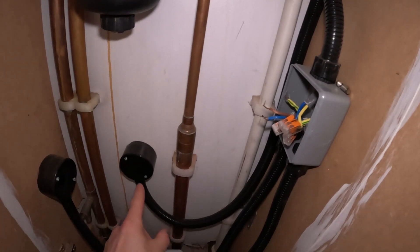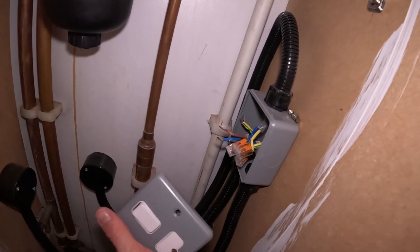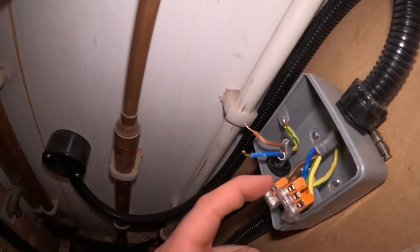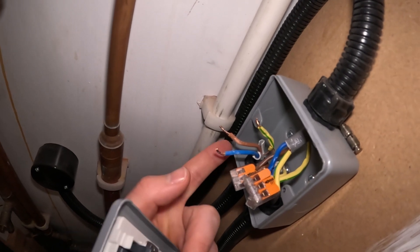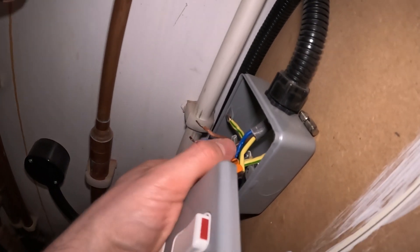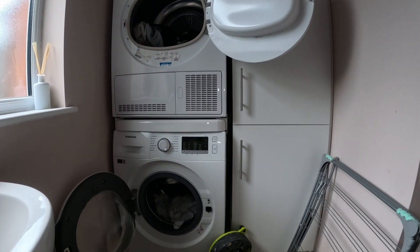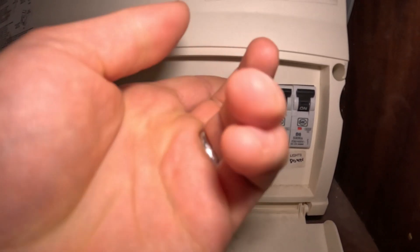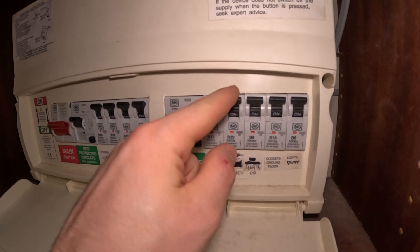In here I just have this fuse spur so that I can switch off the socket outside — it's just a spur off the radial. What I've done with these WAGOs is split the circuit. These exposed cables are the other end of the radial, and I've wired in the outdoor socket with WAGOs. So now when I turn the RCD on, if it trips I know it's probably the outdoor socket; if it doesn't trip, I know that it's the sockets that power the washing machine and tumble dryer. Going to try the RCD now. Turn it back on — and the RCD hasn't tripped. So most likely it's the washing machine or tumble dryer circuit.